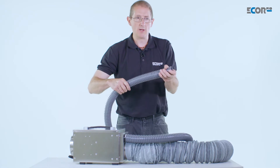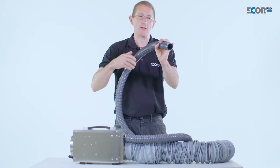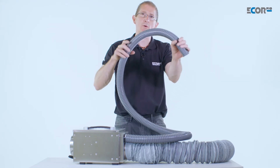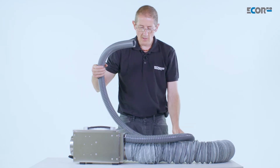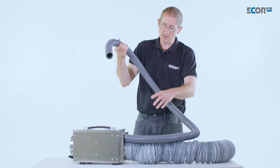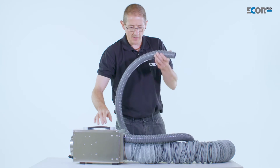On this particular machine working in its applications, the best option is to have a permanent installation where this machine's vapour can exhale from. Otherwise this would have to go to an opening to an external source. The length of pipe is critical — if we extend the length we extend the resistance, and that's going to impact on the machine.